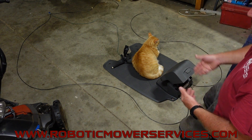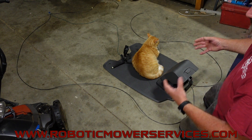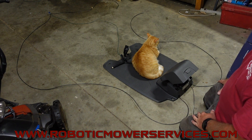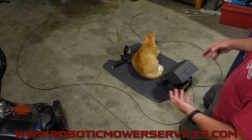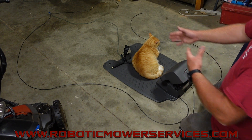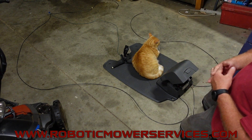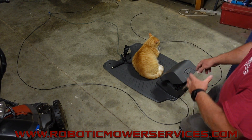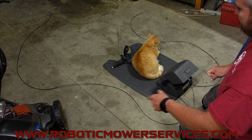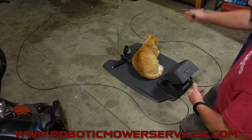Simple systems with one guide wire — like the 300 series or 115H — it's not too bad because usually they don't have a huge boundary system like the 400 series mowers, which cover a lot more area. The nice thing with the 400 series is that with multiple guide wires connected you keep breaking down the search into different sections. We do this quite a bit — it helps us decide which side to hook our tester up to in order to get to the break the fastest.